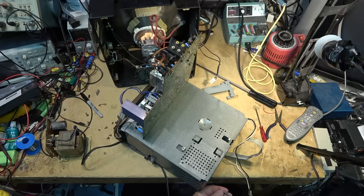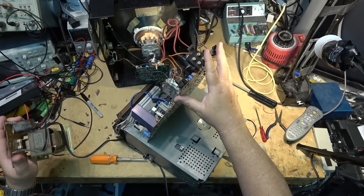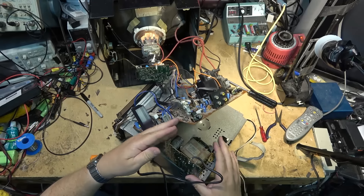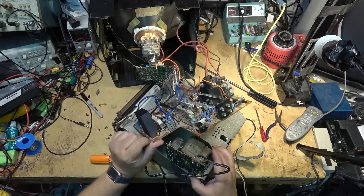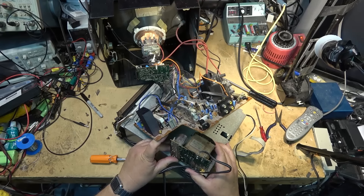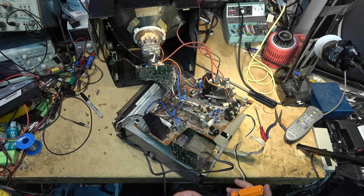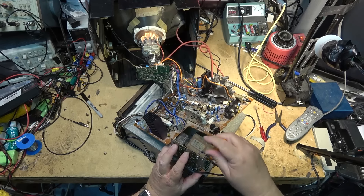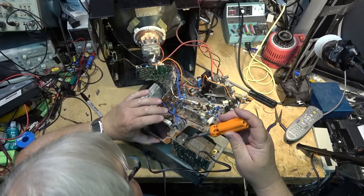This was not a local unit — I found this in a back alley about 10 years ago in Burnaby. Board's back on now. I've got to put the power transformer in first — the power transformer goes in like this, it slots in there and bolts down in two places. It goes in there like that, and then there's a screw that holds this in place — two screws actually for the whole transformer.